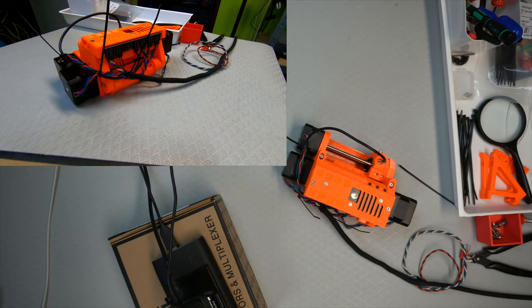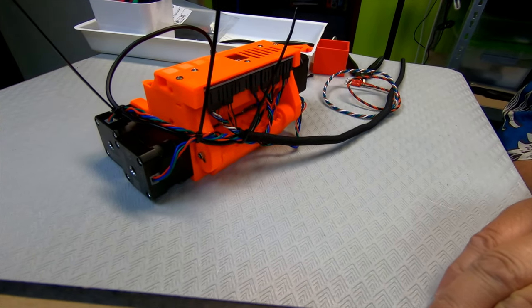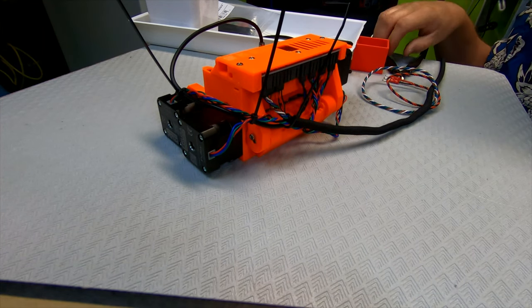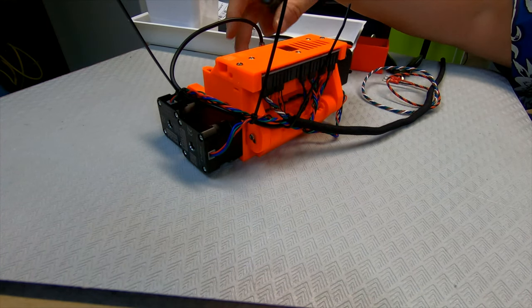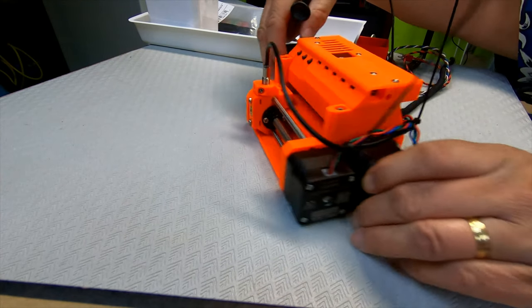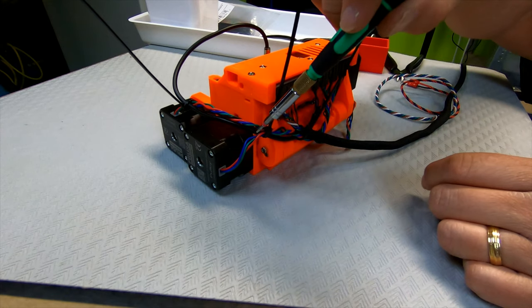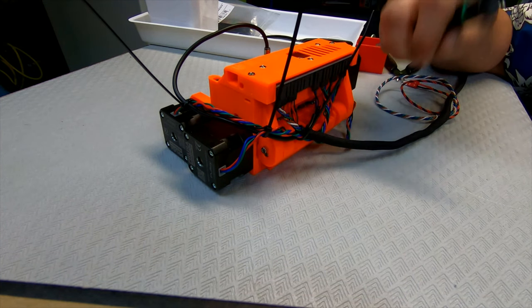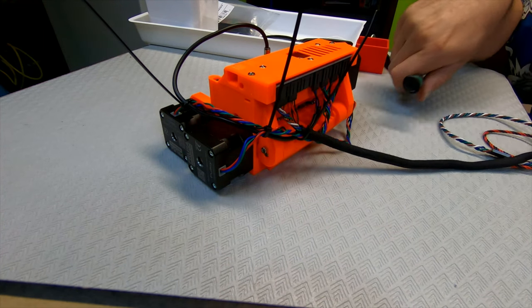Okay. The cable for the sensor all the way around, make sure that this is over here, and then we pulled the cable around to the side and made one connection with the motor cable there. Then we came over to this side, bunched the motor cable from the side and the Pinda cable, put a zip tie there, came along here, put this wrap around the wires going to the printer, and then we grouped it up together and fastened it. So that's how far we've come now.